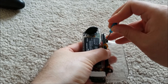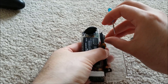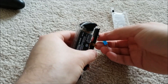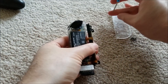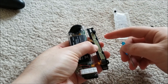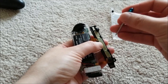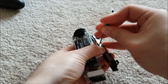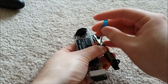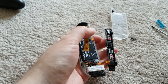So what I would do is remove this one screw here. I just left everything attached because it's too much of a pain to try to finagle everything. Ribbon cables, once you detach them, are really difficult to get back in sometimes. So once that screw's out, this is free from the back half of the casing. There are just two screws holding this board and it's essentially a flat flex with a stiffener. You don't want to lose any of these little pieces here.